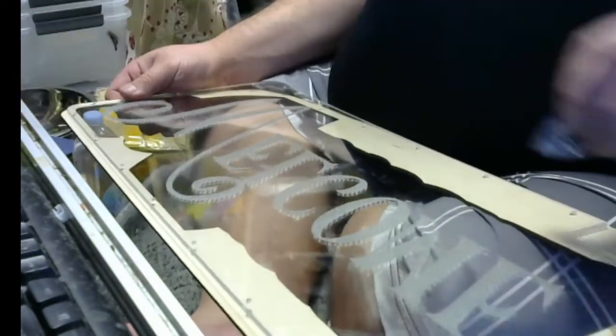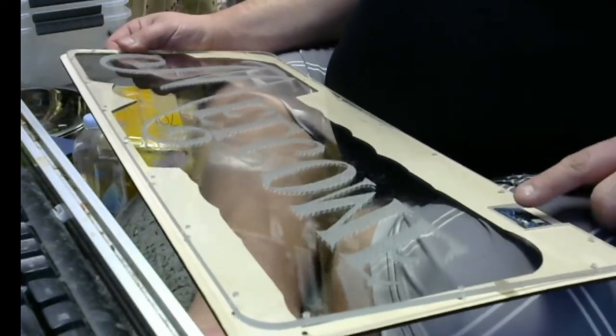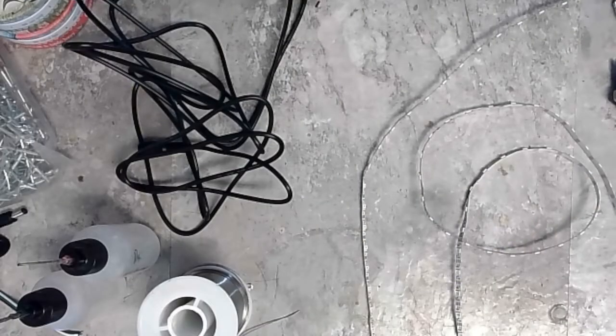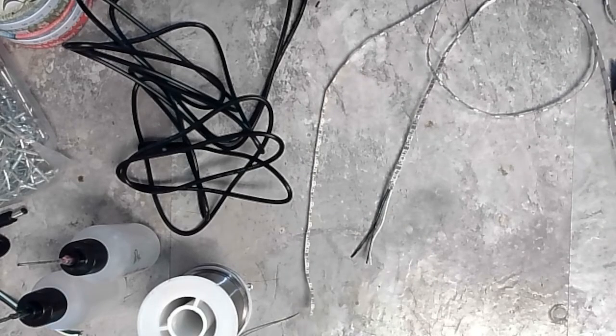Okay, so let's start putting this thing together, and we're gonna go to lap cam here because that's where I like to work. Okay, so I've got an ESP8266 that'll go in here, right? That'll fit nicely. Okay, and then I got an LED strip. I guess we can go back to the bench cam for that. Okay, yeah, here it is. I already soldered on three little cables. Now, soldering cables onto the 4 millimeter strips is kind of hard. So, I might have a video just on that eventually because it is kind of a pain. Okay, first thing I want to do here is, I guess I'll program this little chip.